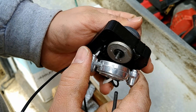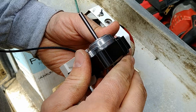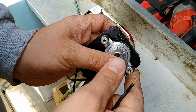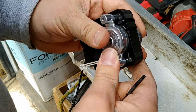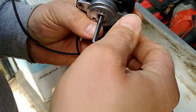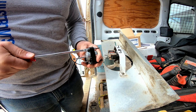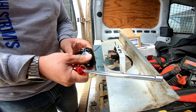So that bearing assembly just comes off of this side here, and then the side comes off as well. Then we just turn it around and drop it on the other side. You have just mechanically reversed a C-frame motor — pat yourself on the back. It's pretty nifty. Make sure that it still spins freely, which it does — it spins perfectly. So now we should have a counterclockwise C-frame motor ready to go.